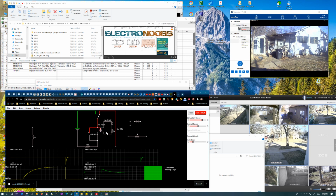In an AC transformer, it has everything to do with the rate of change, because that's why you've got that ratio, 100 volts in, 10 volts out, because you've got an AC waveform going into it, which is constantly changing. That's responsible for generating that ratio continuously. But here, we're not talking about that. The ratio is totally irrelevant. It doesn't matter that I charged at one ratio, except to say that I had one current, 1 amp flowing through it, for example, but that was to maintain a certain magnetic field.